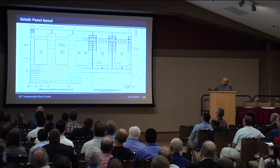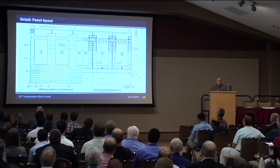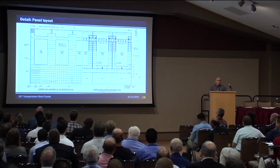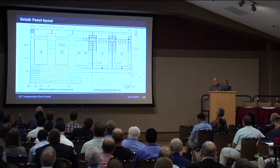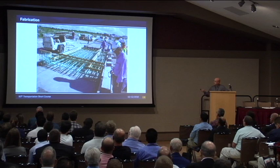Here is just the regular panels with the actual steel that's in them. Our reinforcing in the interior panels is the same reinforcing, same spacing as we would have in a normal deck. Through the gap region, however, we have a number eight bar on top and bottom, and that's just to keep that gap stable during handling and concrete placement. And at the fabrication plant, this is just a panel before concrete placement, no forms. You can see they used epoxy coated steel on these panels.